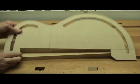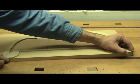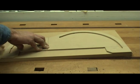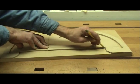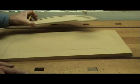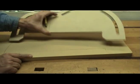This blank I just made can be used as a template to cut out other material. I'm going to need three other pieces of MDF. I'll line these up where they need to be and trace around them on three separate pieces. I'm then going to go to my band saw and cut, leaving about an eighth of an inch all the way around. Then I'll use this as a template on there and put it back on my router and flush trim it.